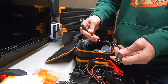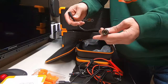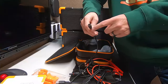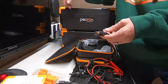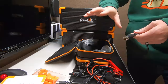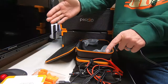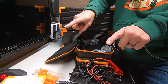So this one basically is, say you have a 100-watt panel, one of the little baby panels. We all have to start somewhere, guys, so there's no hate in the game. I had to start with a 100-watt panel. Matter of fact, I started with a 2-watt panel. They'll give you stuff like this, and that way you can plug it into the 5-pin, and then boom, as long as, remember, your voltage has to be high enough to get that 5-pin to activate. Even though it says 32 to 95 volts on that port, the batteries now are actually 12-volt to 95. That's a huge plus with the batteries over the main system. Your array is from 12 to 95, where the main system, you have from 12 to 18, which is actually 25 open VOC, open circuit voltage, and 32 to 95. So there's that little gap in there, right? This one, there's no gap.